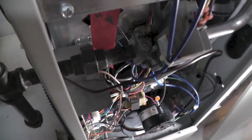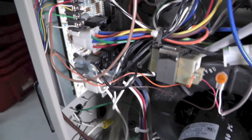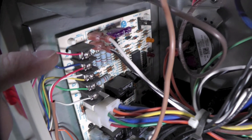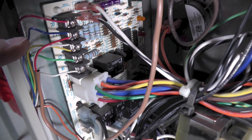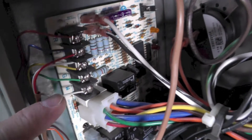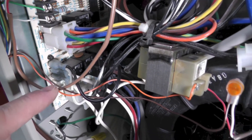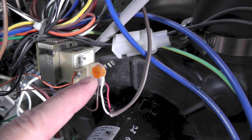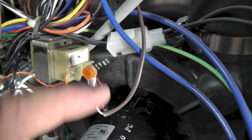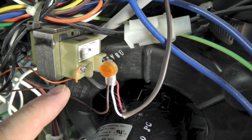Let's go investigate my internal wiring on the board in the furnace. As seen in the previous diagram, I've attached the wires — red, blue, yellow, green, and white. I've left the red and white going out to the AC compressor where they were. The brown wire coming from the interface comes over and gets spliced into the white wire going to the humidifier. The red wire to the humidifier stays where it was, and the orange wire goes from the 24-volt step-down transformer back over to the interface box.